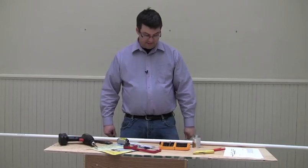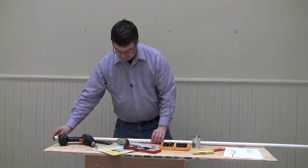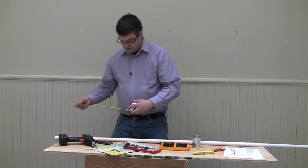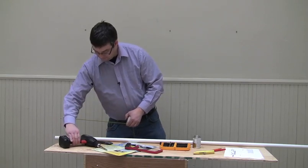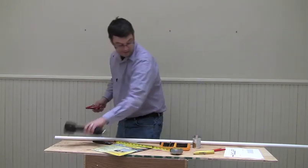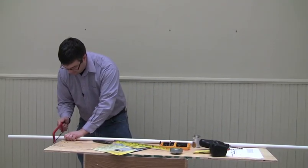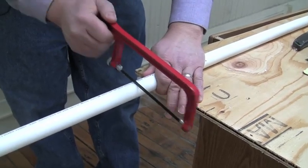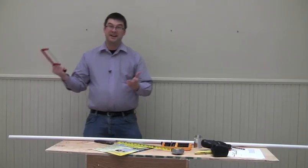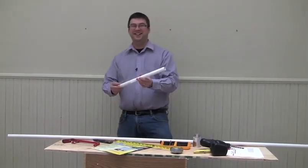The first step is cutting the length of the pipes. You have to measure the flute to 15 inches and 9 sixteenths, and I've already marked that here on my pipe. Then we'll just saw through that, get it started real slow, get it going. And maybe you have a better hacksaw than I do and it can go a little bit quicker. But I already have one cut here.